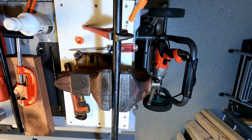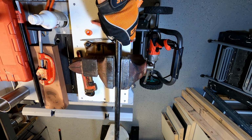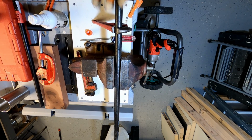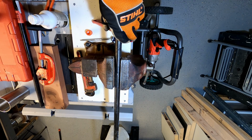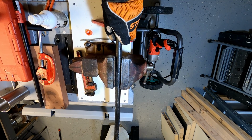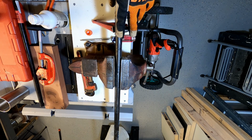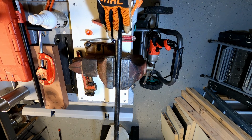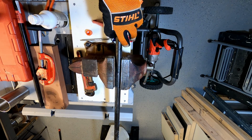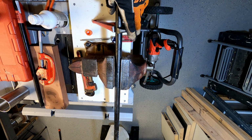This can come loose and pop up and fly and hit you in the head, and so that's kind of dangerous. But if you hold it, you should be okay. But if you let go to do something else and you crank on this, this thing could just fly up and bust a knuckle or bust your head. But we got the pipe wrenches gripping down, but it loosens back up when you let off. And so if this moves a little bit and then this comes loose and it's not fully tight and then you twist it, there can be a lot of pressure that builds up real quick and this thing will just go spinning around and cause a lot of trouble.